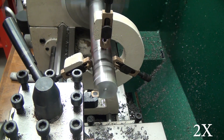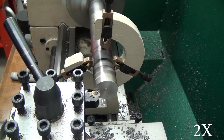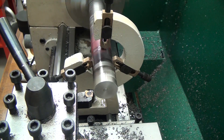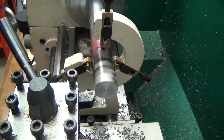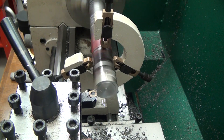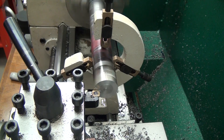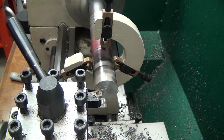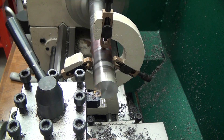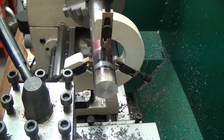This first cut is supposed to be a cleanup pass and it goes okay. On the second cut I'll slow back down to regular speed so you can see it — right after the cut starts, watch that top finger. Yep, that went — the material started to be able to move away from the cutter so it was rubbing and making a screeching sound and it was awful. But like an idiot I went ahead and made my cut until it moved where you saw right there — it totally jumped on top of the tool.